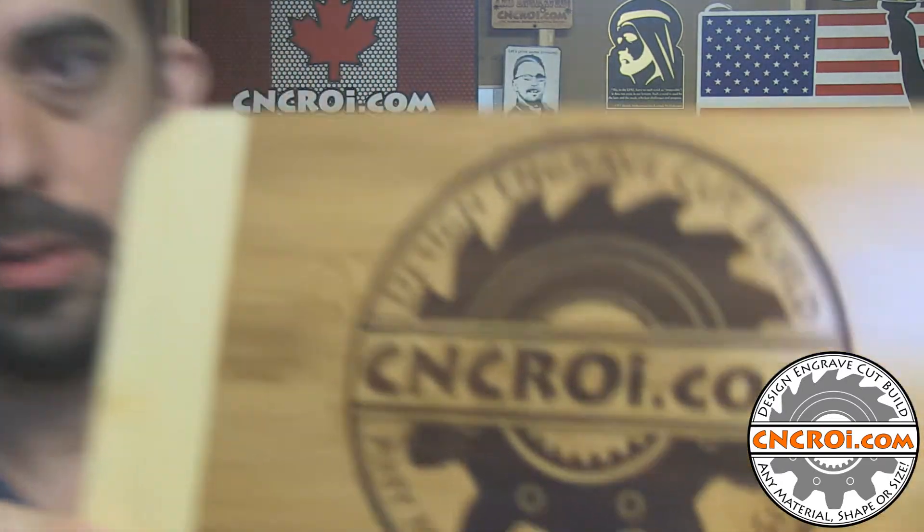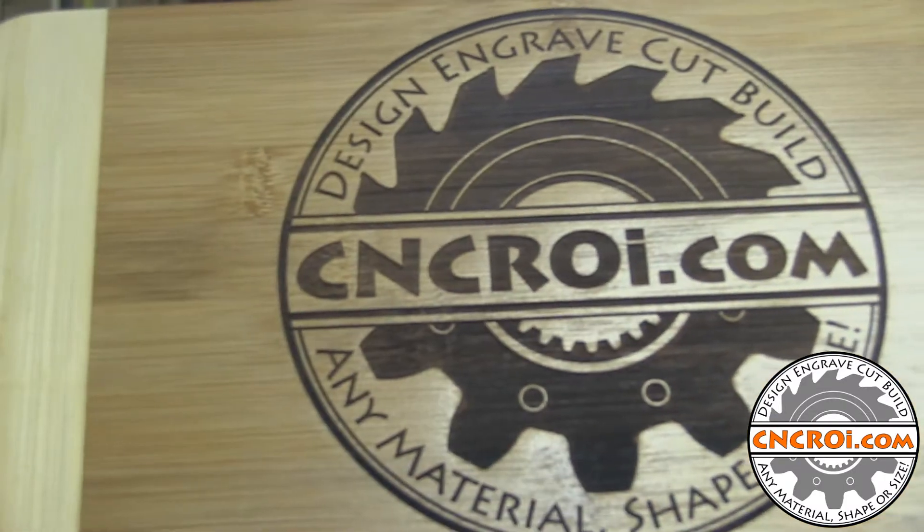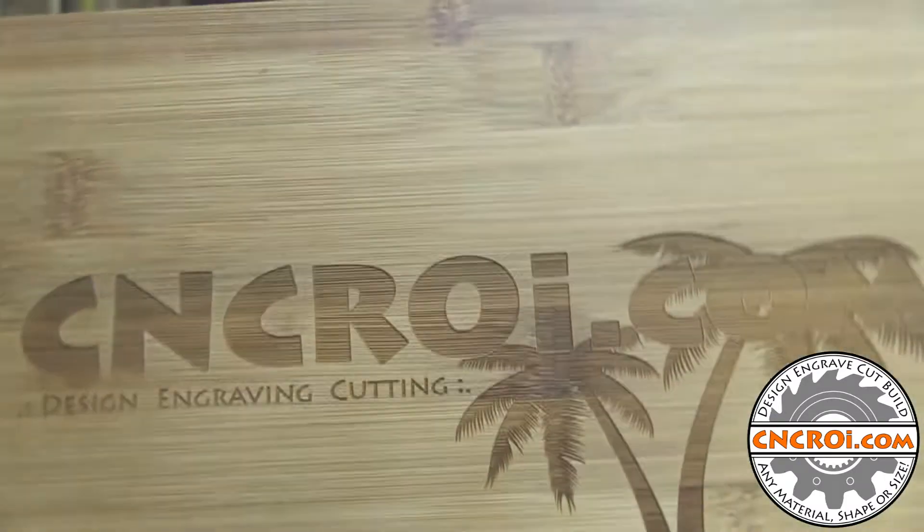So what we do is we put the laser out of focus and do a secondary pass. The focus of the secondary pass is not to engrave more into the board — although that happens as a result just a little bit. The focus is to darken it. So you can see here close up, this has got a layer of black around it just to give it a bit more shine.